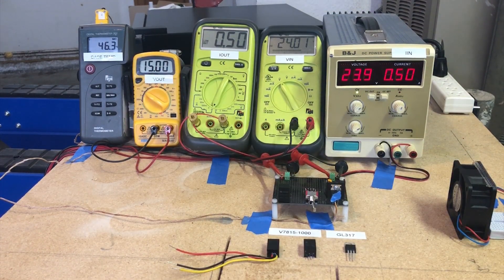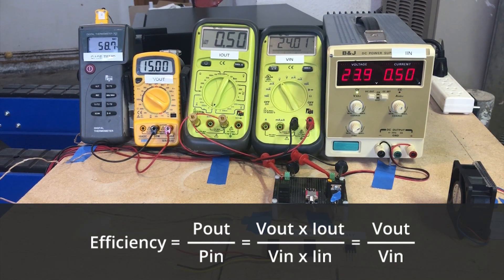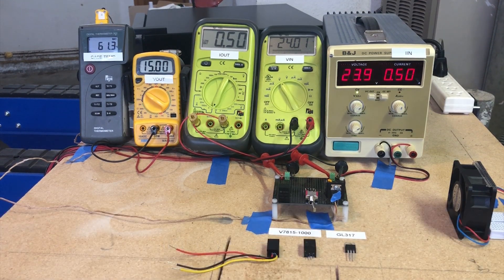As you can see, this leads to a large increase in case temperature — we're already sitting at about 20 degrees above ambient and the temperature is continuing to rise. The large amount of power dissipated in a linear usually means some form of thermal management is needed. An interesting characteristic of the linear regulator is that input and output current are the same. As a result, the efficiency calculation can be simplified to V_out over V_in, since both currents cancel out in the P_out over P_in equation — giving us 15 volts divided by 24 volts, the same 62 percent efficiency.